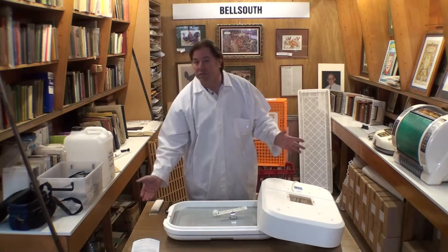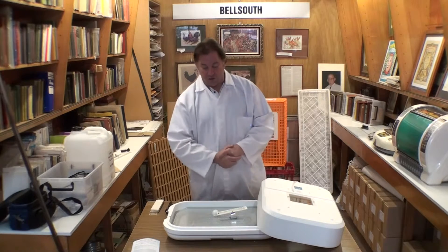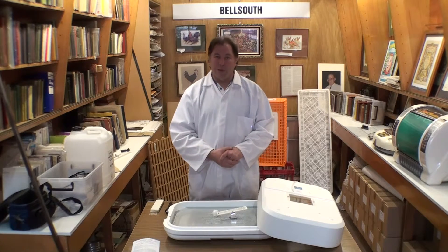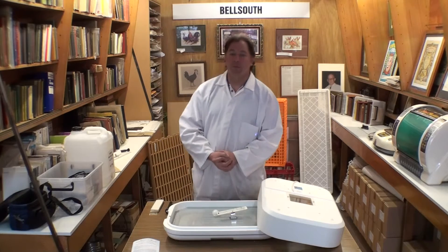You may decide that you're not going to use the incubator for a while. Put it out and leave it in the sun for a little while so that the sunshine does its sterilizing job. Pack your machine up nice and dry when you put it away. The worst thing you can do is pack it up wet, or with shell and chick remains inside — that guarantees the incubator won't last very long and won't be very successful for you.